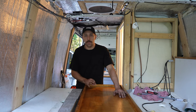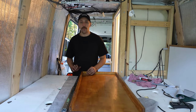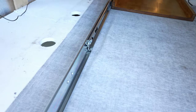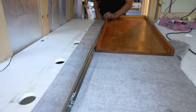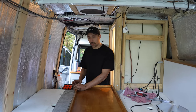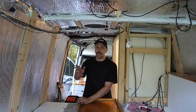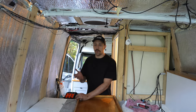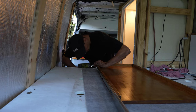It's been a bit of a break since we built the table but we're now going to move on to installing it under the bed. For that I've got these one meter long drawer slides — they're the locking type, so it'll lock in place and won't come out, and it'll also lock when it's out and stay out when we want it out. We're going to start by attaching the table to the drawer slides, then attach the slides to the supporting rails that we'll screw down from the top of the bed, and then hold it in place and screw it down.